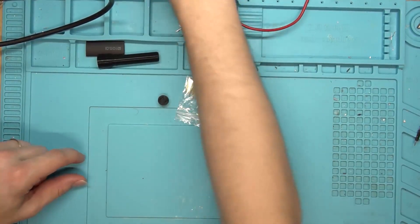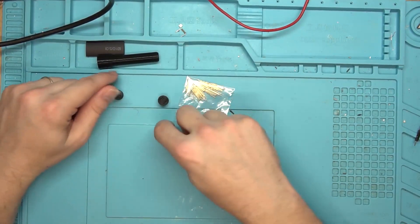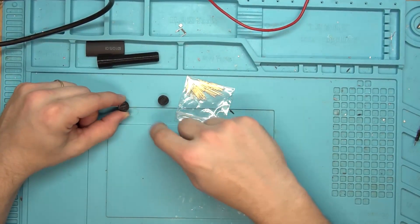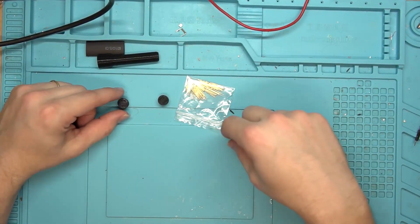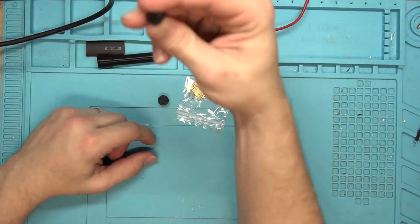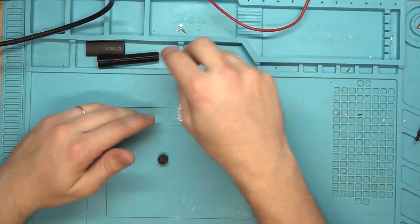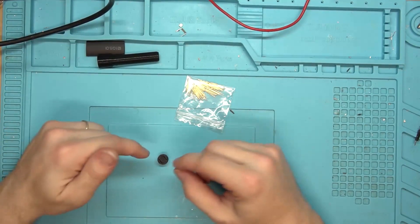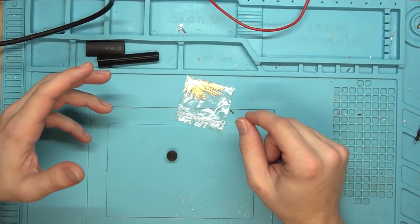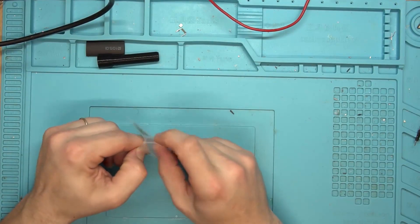It's a good trick to get the part to stick. If you've already leveled it and cleaned it with isopropyl alcohol and you're still not getting good adhesion, put a little bit of glue stick, then wipe it down with rubbing alcohol again. That way you have the thinnest layer of adhesive on there and you'll get really good adhesion. This is especially helpful on glass beds. This one didn't come out quite perfect — when it 3D prints, it prints the walls and then fills in. These little holes are just one tiny circle, so if one shifts a little bit it'll plug the hole.